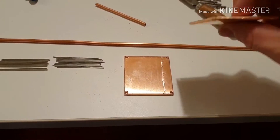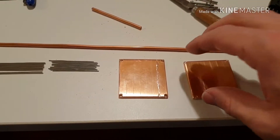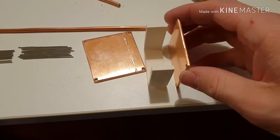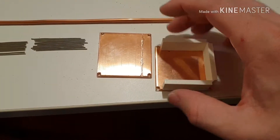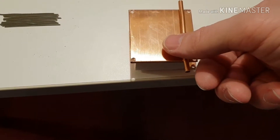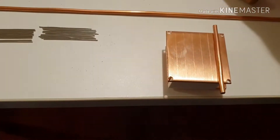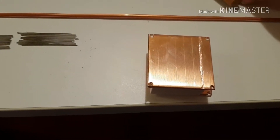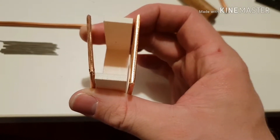So here's the plan. We have two copper heat exchangers, one per Peltier, and the heat exchange block we saw before — the water exchanger — will go in the middle. So we'll have a stack-up with a plastic spacer and the heat exchanger in the middle, with a copper plate either side. These two plates end up bolted together with lengths of copper pipe soldered on — six on each side, all wired together with some PVC pipe. The whole thing will be compressed with M3 screws on the edges, compressing the Peltiers with the hot sides facing inwards towards the heat exchange in the middle, and the cold sides facing outwards, cooling each plate. The drink will go through one side, then through the other, and then into an output container.